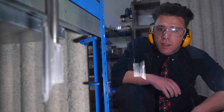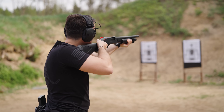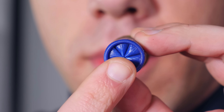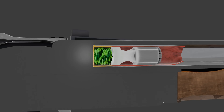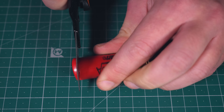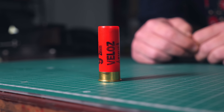Something here is not right. I'm getting a bang, but it's not a big bang. What's happening is the propellant is not burning — it's getting stuck inside of the axe. And I'm guessing the reason for that is pressure, or better yet, the lack of pressure. A regular shotgun shell has a crimp that closes the casing and it's really hard to open. It also has heavy metal pellets and a piston. All of this creates resistance that delays the expansion and gives time for the propellant to burn. When I open the shells, I get rid of the crimp and remove the shot and the piston. I need to find a way to close the shell again.